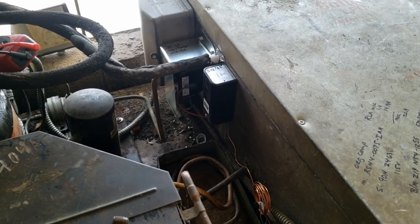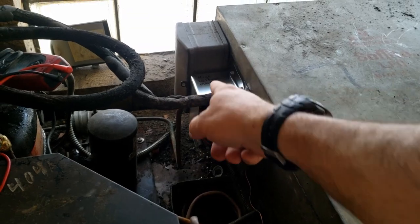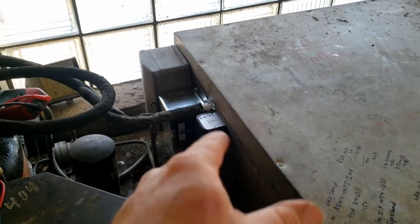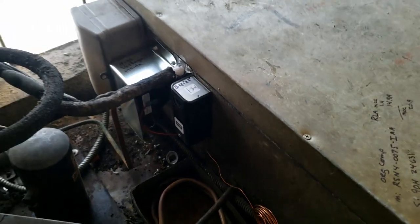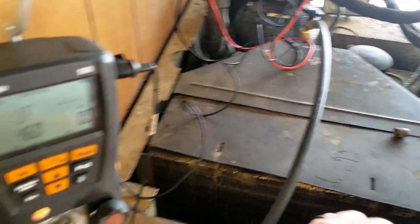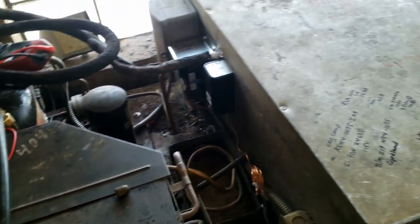The thermostat had been replaced and we kept losing thermostats, so I put an isolation contactor with a 120-volt coil and built a little cover for it so the contacts weren't being destroyed inside the thermostat. The thermostat can only handle about 16 amps, and this thing was pulling 19 at startup. So we've already got a superheat issue.